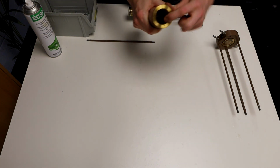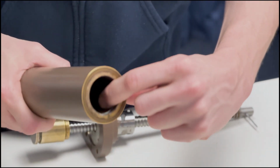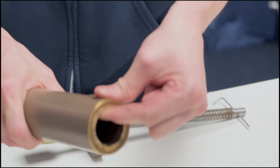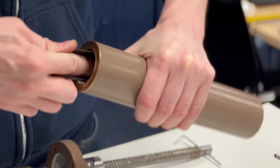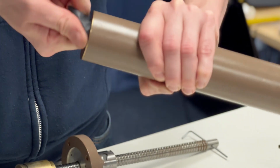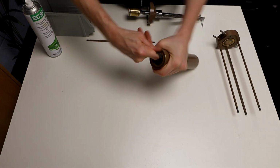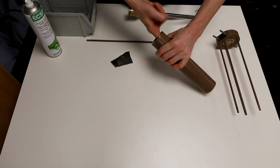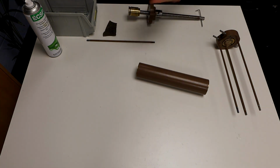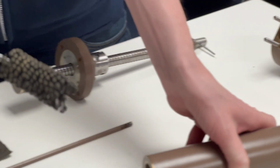The rear end of the barrel should feel clean and smooth, whilst the other end may be visibly dirty and feel rough. So once again, we use a small amount of wet and dry paper to try to gently remove the dirt or hardness, but not any material from the inside. If it still feels rough, you should use a honing tool to gently clean the cylinder.